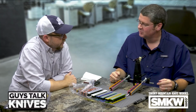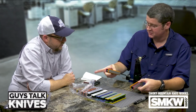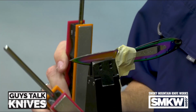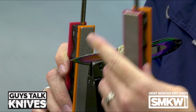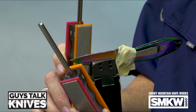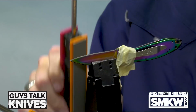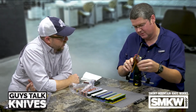Awesome. Cool. So let's get at it. Now I've done the 100. I just flip over. If I was using the Lansky, I'd go to the next stone. And again, coarse abrasive. As you're doing this, you'll see very big scratches, and then it'll start coming in as smaller scratches. As soon as you see the smaller scratches, you can move to the next abrasive. So you're just removing the scratches you just made and making new scratches. Either with the Lansky or one of these, you can go back and forth, or you can just do a smooth stroke down.